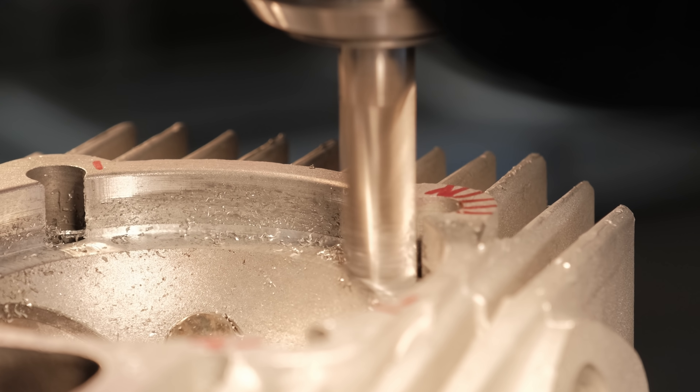A little nerve-wracking because how many heads do you have? I don't have that many - this is like my last spare head. I've got 1500 RPM - hear that? It's just touching. I'm going to set this to zero. I'm going to take two cuts of 30 thou - actually maybe three cuts of 20, I'll be on the safe side. This is a long way off the table, so if you take a heavy cut you can get vibration. We don't want vibration.